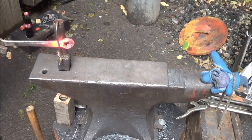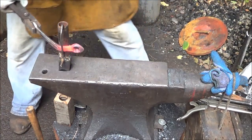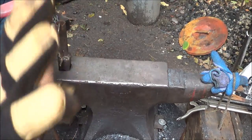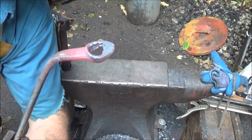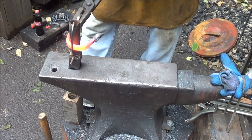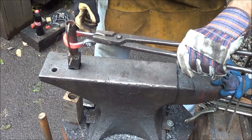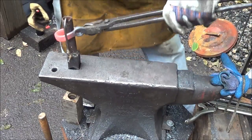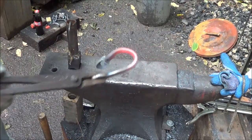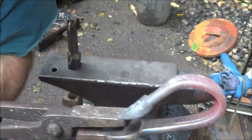On the opposite side, go ahead and start wrapping your curve. This wrench is a little bigger than the ones I've been working on, but just go in detail — put a little hook up on the end and then start curving the other way. What you're going for is trying to bring that end, or the tab part, about halfway — maybe a quarter of the way. I'm trying to get this end part about a quarter to a half of the way up the flat spot on top.